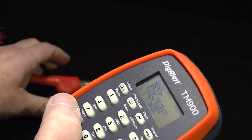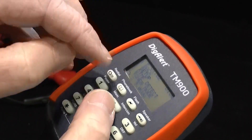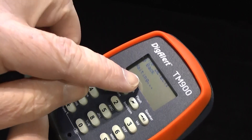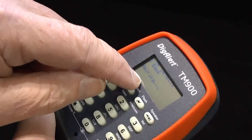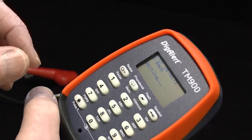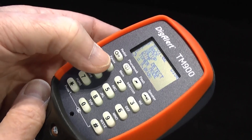Option two on this menu allows you to detect DTMF signals — whether that's incoming DTMF caller ID, from an alarm autodialer, or something similar. So you can hook up your telephone in parallel with an alarm autodialer, switch it into mode two, and then it's ready waiting for any DTMF. Any DTMF symbols that appear will be shown, and you also see an approximate power level in dBm, which is quite useful for debugging whether it's sending a sensible level.